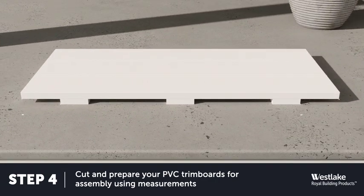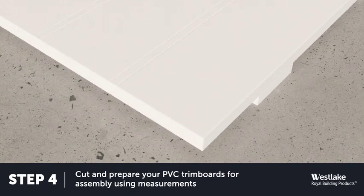Now position the 1x4 trim boards 5.5 inches from the ends of the 1x6 boards, and center the middle 1x4 batten. Secure each 1x6 to each 1x4 batten with 2 1¼ inch exterior screws per board. Once your assembly is complete, remove the spacers.